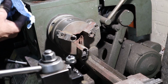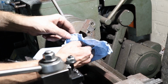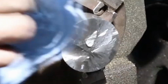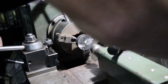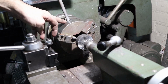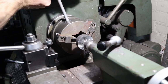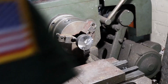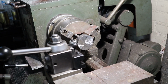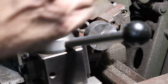All right, I got my chunk of steel cut off for a cap. I'll get this chucked up in the lathe and flush it out because it's not the greatest cut. And it's still hot. So I got this napkin. So I like to keep this loose and just drive this pin right into it to get this nice and flush. Should be good. Doesn't have to be perfect over here. Put that guy back in.